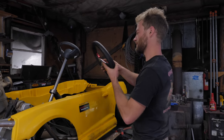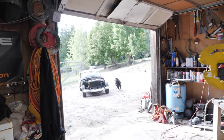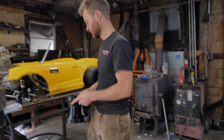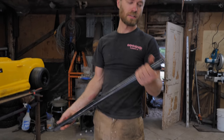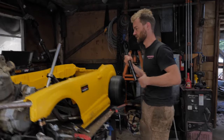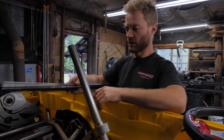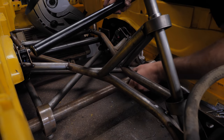Oh, you want to be a part of the video too, Bjorn? Most of this box is taken up with wheels for the off-road tires. These things are incredibly lightweight - they weigh like nothing. Also a hollow inch and a quarter axle for the jack shaft, because first of all we can save weight by going hollow, but more importantly this piece of inch and a quarter we had only has this one little section of keyway which isn't in the right spot.